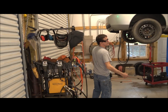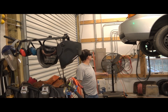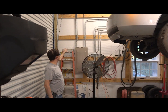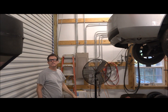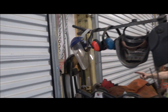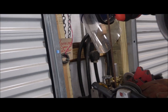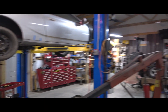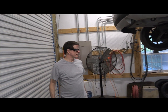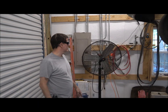As I was saying outside, once I had the shop built, I had the main panel put in. I paid to have that done, and then I did all the electrical work from there by myself. Got a 220 outlet in the front for the welder and a 220 outlet on the center of the wall in the back for the welder, so I can use a shorter extension cord to get around the shop.